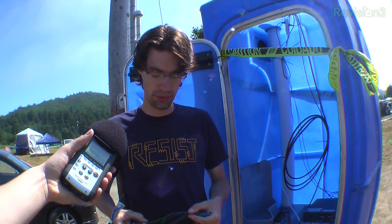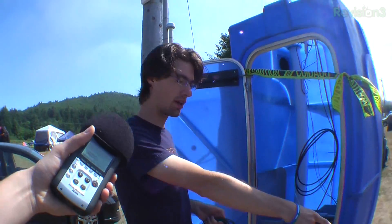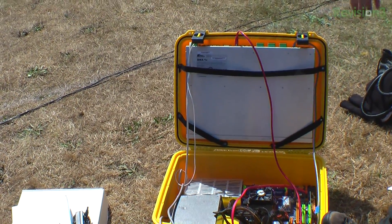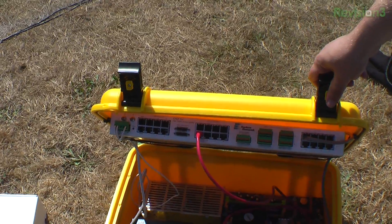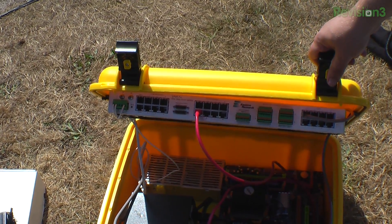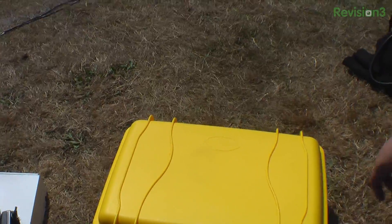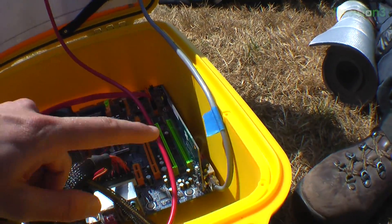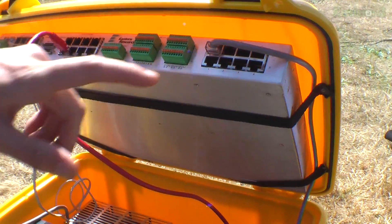It takes a lot of equipment, as it turns out. One thing we've got is a computer in a bin, and on top of that is an E1-T1 switch — a device that takes in a bunch of lines. It's got an ethernet switch, a T1 switch, some serial ports, and it's basically like a Linksys router for a cell phone site — it does the multiplexing and everything. I've got one card inside the PC; that card is an E1-T1 card, a Chinese knockoff of a Digium card like you can buy for Asterisk — cuts about $130 on eBay. That spits out one line, which gets split out into a bunch of different lines, each one for each base station.